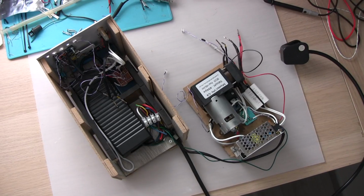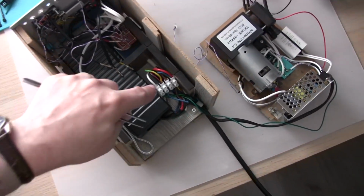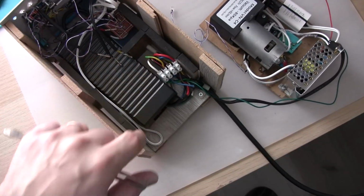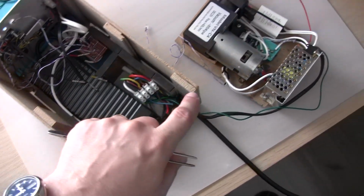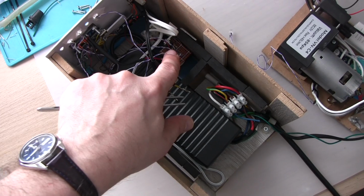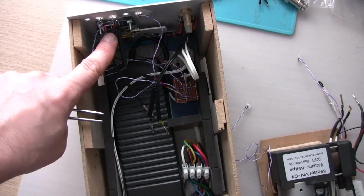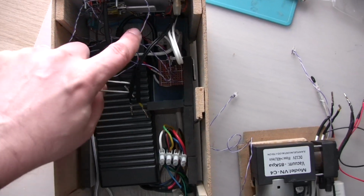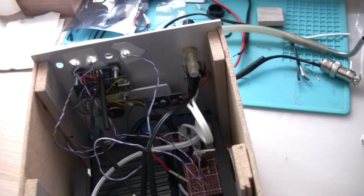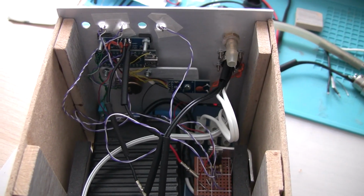All the parts are ready to be assembled. The ground floor part. So once again, PSU. There is in this section isolated high voltage mains distribution that goes to the PSU, and then to this PSU and this PSU. The MOSFET sits over there. It's wired to the socket. Here is the Arduino Nano, OLED display, switches, potentiometer, MAX converter for the K-type thermocouple.